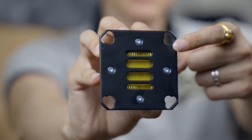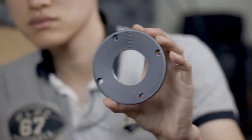This is the JET 5 tweeter. Elac took over the JET tweeter system in 1993 from a Berlin speaker company called ARES, and since then, for almost 30 years, they have honed this tweeter and implemented it in many of their speaker models. Elac's signature JET tweeter is their advanced development of Dr. Heil's air motion transformer — a transducer without the conventional voice coil assembly. The JET tweeter has a folded Kapton foil membrane squeezing air out of its folds at high velocities, not in the direction of the listener but crosswise.